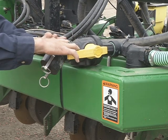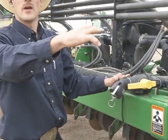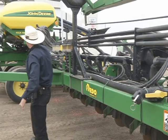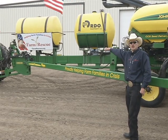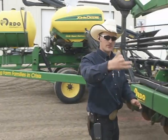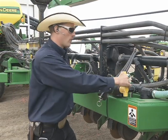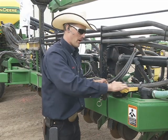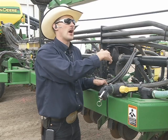Take the cap off, connect on, and have the handle like this. The farmer will have something like a five-horse Honda on the back of his tank, and that will cause a pressurized system to pressurize the line. It'll flow in through this big line, all the way up, around through the mainframe, and then into each individual tank. Make sure the valves are open at the base of each of those two tanks to allow them to fill to whatever level desired. Once the tanks are full, shut the motor off, then take this valve and turn it to the off or pump position. Now you can take the hose off and replace your cap. With the valve pointed towards your supply line to the pump, you are ready to start applying fertilizer or insecticide as you go through the field and seed.